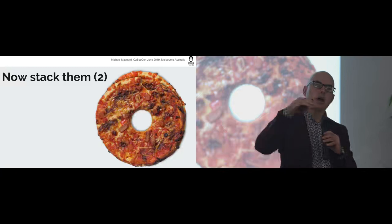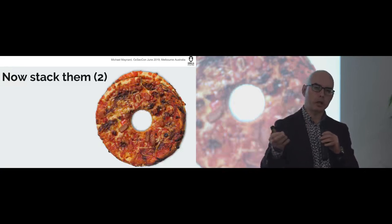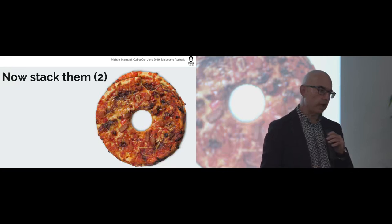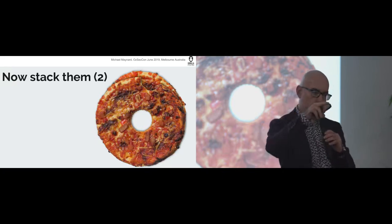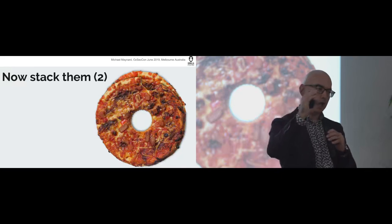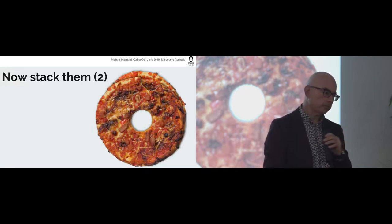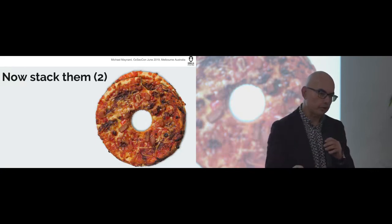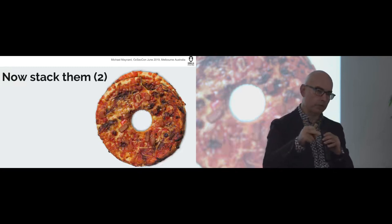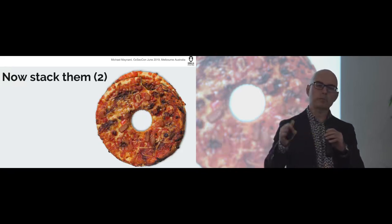Excellent. So the question was, can we game the authentication stage of this lock? Can we somehow negate that? And the answer is very definitely yes, we can. If we drill a hole and we drill off the fence, so we go through the front of the safe, we drill a hole, we blast that fence off there, at that point the lever can fall into the gate next time it comes around. So a conceptual design where the fence is not ever riding on the wheel pack at all until some later stage. Again, if you can think of a way of making the lock not leak that particular bit of data, a better quality manufacturer has definitely done that with a better quality lock. Real good question.